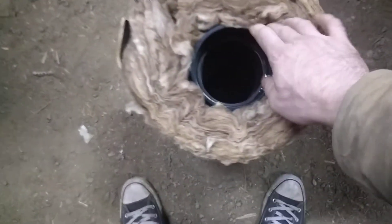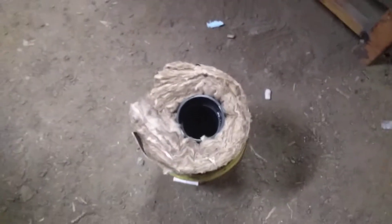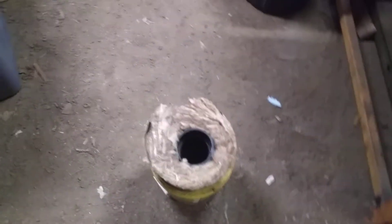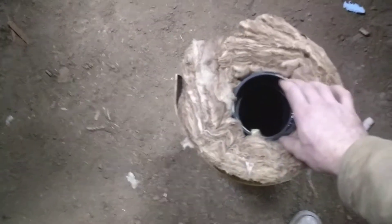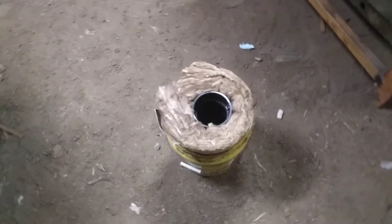My dry ice slurry will go in here, and then once I deposit the blades, I will put this next chunk of foam insulation and press it down to the pipe, then put something heavy on it so it's completely encapsulated in insulation. I think it will be just as good as a cooler and much more containable and less messy. The pipe costs about 15 bucks — everything else I had laying around — so it's a very inexpensive way to create an insulated, less messy container for your sub-zero quench. Thanks for watching, have a great day.